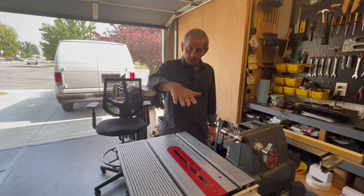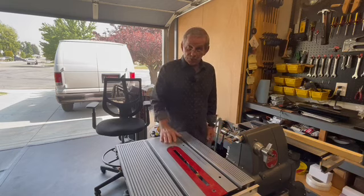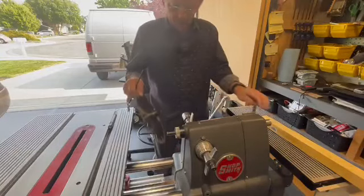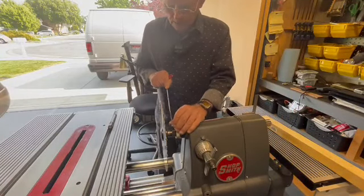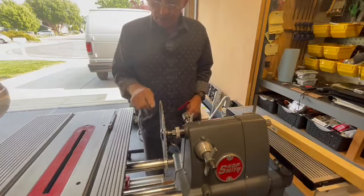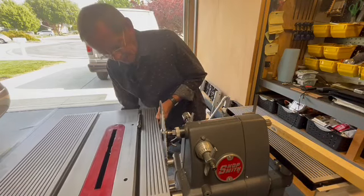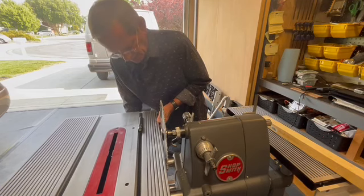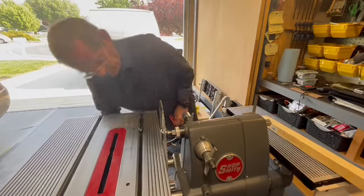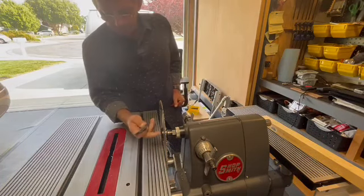We're going to check the table a couple of ways — first this way, then this way, and actually a third way. We'll start with the easy one: checking the table this way. I typically prefer to do this with the disc sander, but you have to do it with no sandpaper on it — the sandpaper is just a series of hills and valleys that would throw your check off. The saw blade works just fine and is probably a little more precise than the disc sander, though you don't have as large a surface. You can see I'm below the center line of the blade itself.